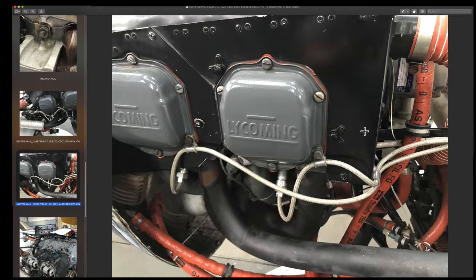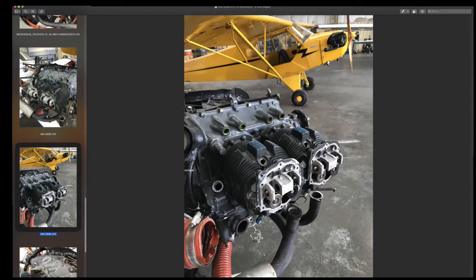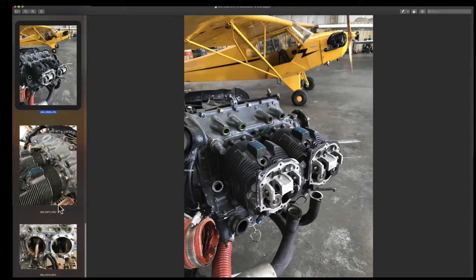There wasn't one problem. There was a little bit of spit inside the cowling when I opened it up, like underneath. If I go to this picture, underneath on the cowling, there was just a little bit, but the mechanic said it was nothing to worry about. And some of it wasn't even in the engine, it was probably on the case. So I did a good job of bolting those down. I'll fly it a few more hours, and hopefully those rings in the pistons and the cylinders will seat a little bit, and I'll get some good compression.